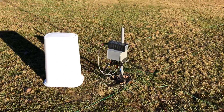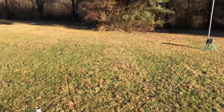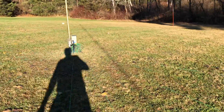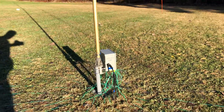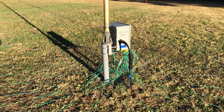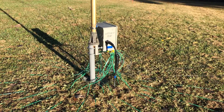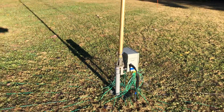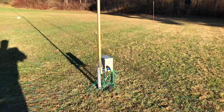There's the center box where everything comes to. Over here to one of the verticals — you can see where the ground radial lines all connect and where the coax line comes in. The big blob there is some ferrite cores that you have to use on verticals to make everything isolated so you don't get any RF back in your coax lines.